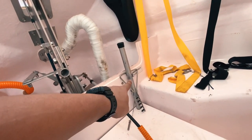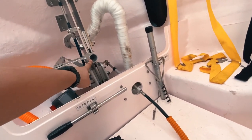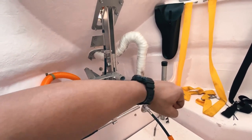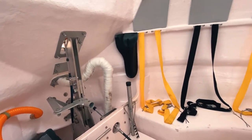Next, there is an emergency tiller. We can take out this handle and put it inside here. In case the main steering fails, we can insert this emergency tiller and control the movement of the rudder and the direction in which the ship is moving.